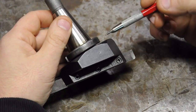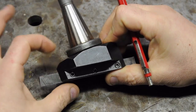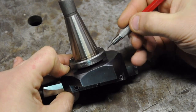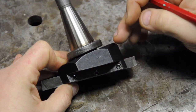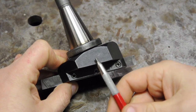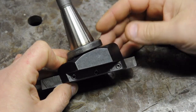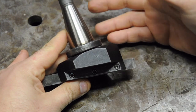The fly cutter is by nature an unbalanced tool. Some fly cutter designs go to pains to balance it — you can see it's thin on one side and thicker on the cutting side, and you'll sometimes see a scallop taken out of the leading edge. You can work that out in CAD, just keep cutting away material on the big side until you move the center of gravity in line with your spindle. But really all that achieves is static balancing — once you fire it up, it obviously is not dynamically balanced.